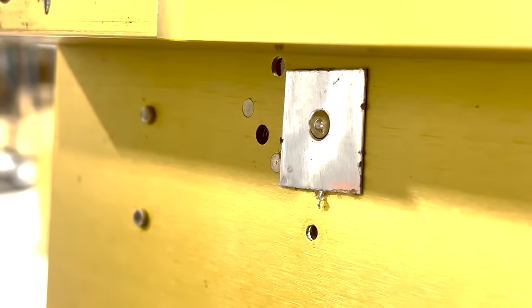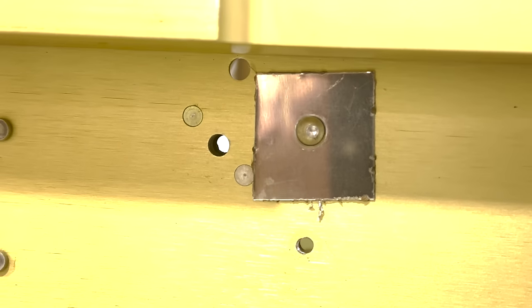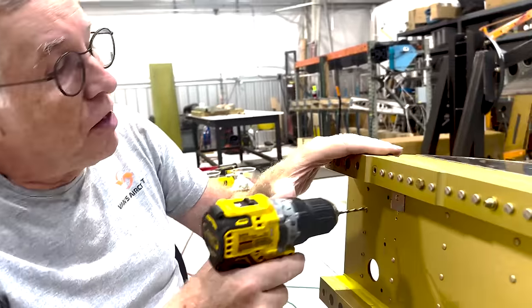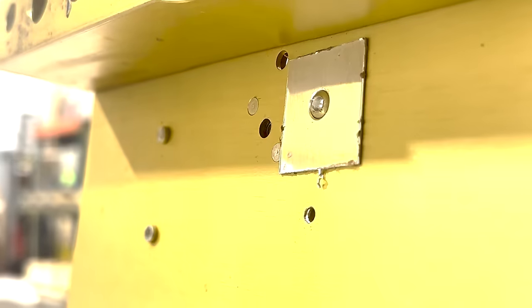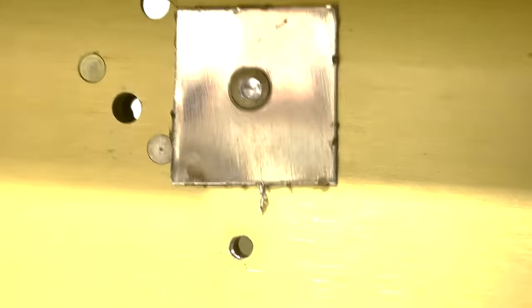I did wander off to the side, but because we're not drilling deeper than the thickness of the head, we're not drilling into the actual spar structure. Now we'll switch to a number 30. Because I did go to the side slightly, I can use the reflection and angle the drill bit to try and bring it back towards center, then straighten out. Now if we look straight onto the rivet, the hole is nearly in the center — close enough to remove the rivet head.